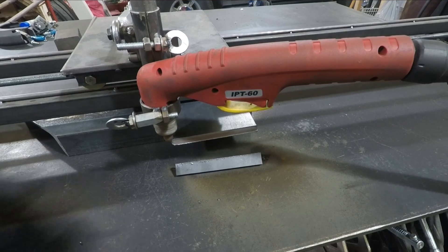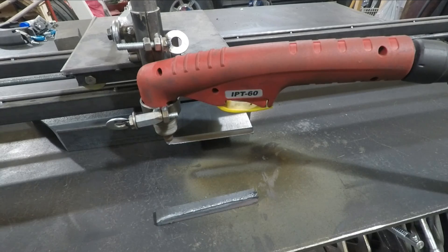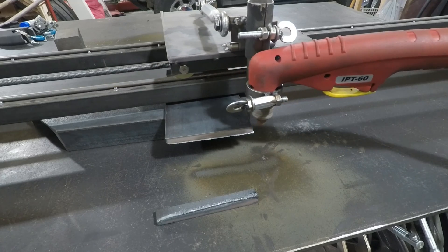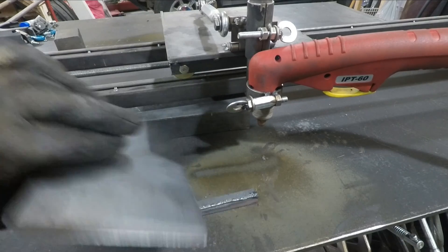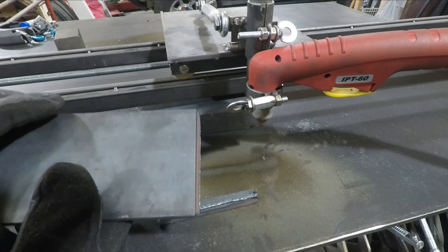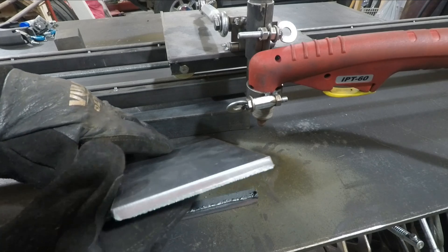With this cut, I didn't do any test adjustments — it's a little warm. I didn't adjust the pilot arc length, distance, or any of those settings. This is my very first cut with it, so I probably could get a straighter cut, but I did have an angle to it. We can see I've got a bevel on my cut — I think I need more air pressure going through there. But you can see how clean of a cut that actually made. That is a beautiful cut.